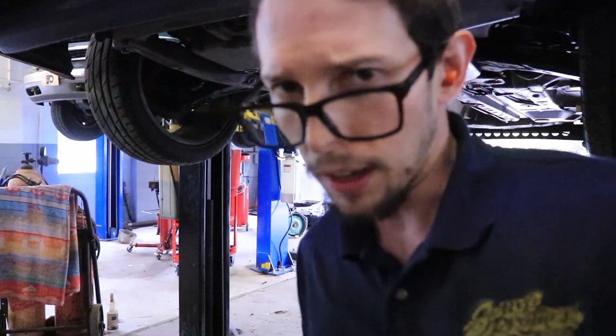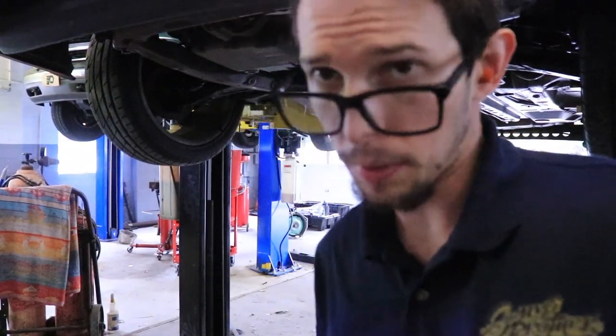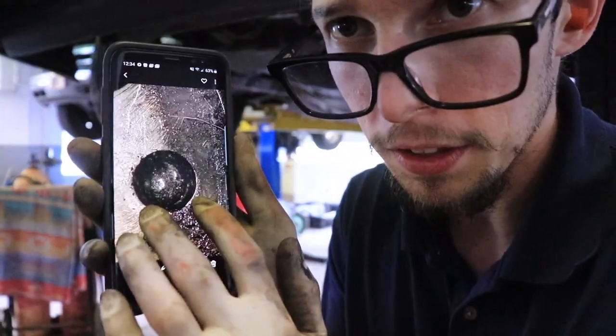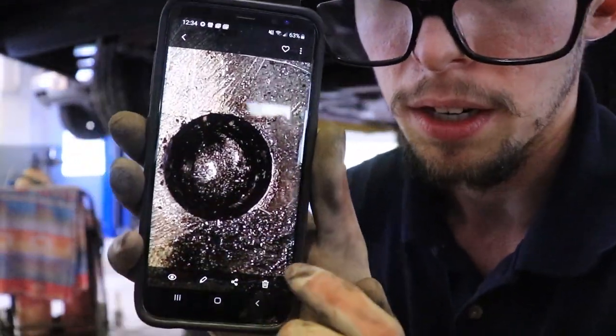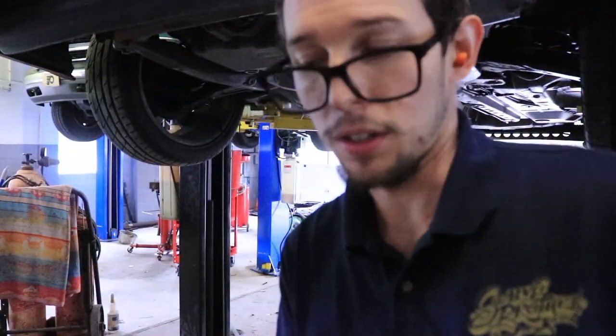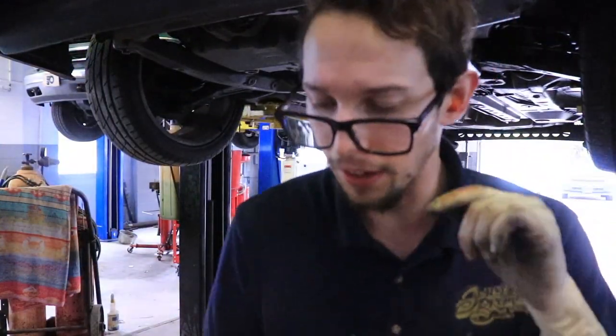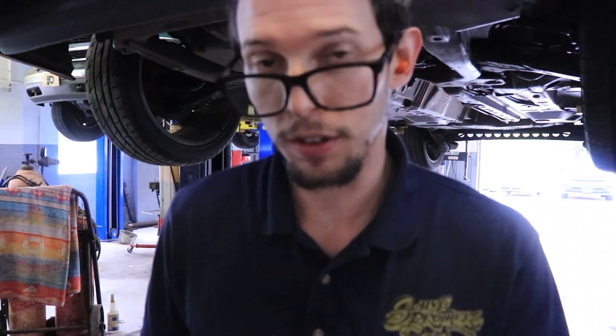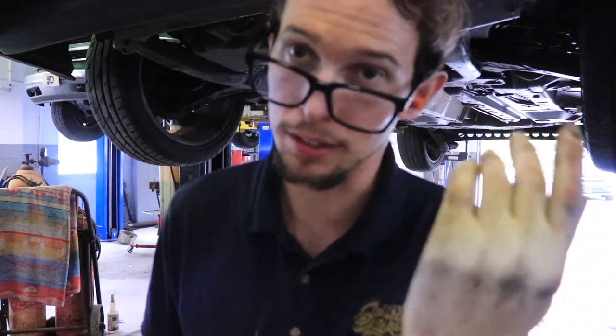Here we go, this is nerve-wracking. Well, I got semi-bad news — it's probably actually bad news. Here's a picture I just took, which I don't know why I didn't do this before. You can see I am definitely off to the side. So what I'm going to do is step my drill bit down, because if I get into the threads I'm definitely not going to get it out. But if I do a small enough extractor, because the other ones are easy to come out, maybe if I put a small enough extractor in I can still get it out. We're going to hope for that and see what happens.